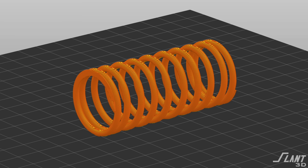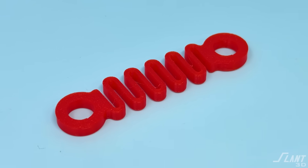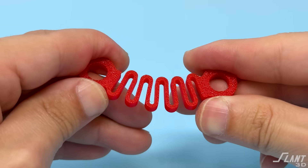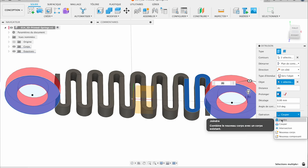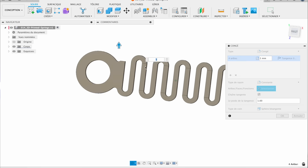If you want to create an extension spring — a standard coil spring function — what you do is instead of doing a spiral, you look at that spiral from the top and create that profile. Now you have a very simple flat-pack extension spring. These are really useful if you want some sort of resistance on a switch or a button. All it is is a simple curved path going back and forth. The easiest way to design it is to create a set of pattern slots and make sure you round out the edges.